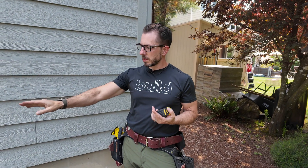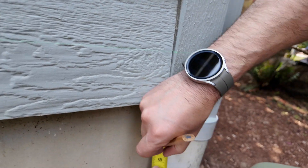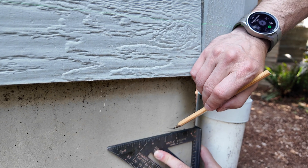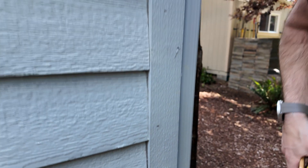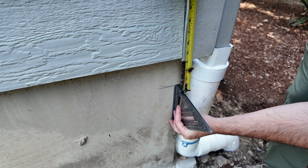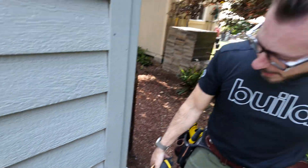So I'm going to use my lowest point, which is actually down here, and I'm going to come down four inches because I'm going to do a little bit of waterproofing later on. So if I come down four inches, I'm going to butt the bottom of this. Now I'm going to make kind of a level line here, and that should help me when it comes to measuring and seeing how far away from this line I am. Sometimes I just wish I had more hands. If I measure from there, that is about seven and three-quarters from the laser.